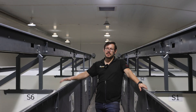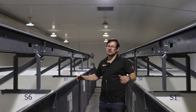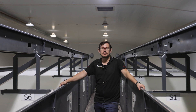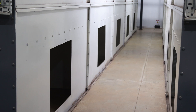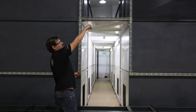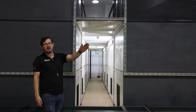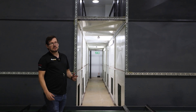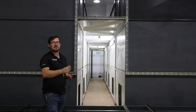It's a very passive system — temperature and humidity fluctuate a little, but versus ambient outside temperatures which vary between 10 degrees at night and 30 degrees in the day, this room is constant. It also serves as a buffer zone if processors can't accept nuts — you can store nuts here for up to two to three months. These bins are standard drying bins with positions cut out for fans in future, not yet installed. When hot nuts enter a bin, the heat causes convection: cold air enters the bottom, hot air leaves the top, and ducting recycles the airflow. In future this room can become a drying room, which is why we've left space for bin fans and oversized the ducting for sufficient airflow.